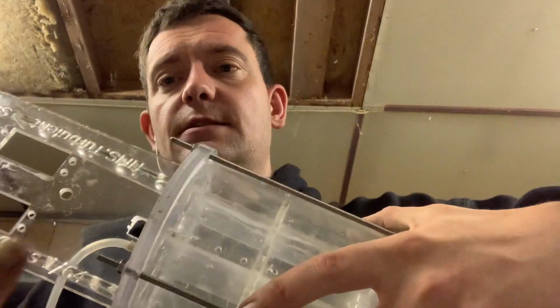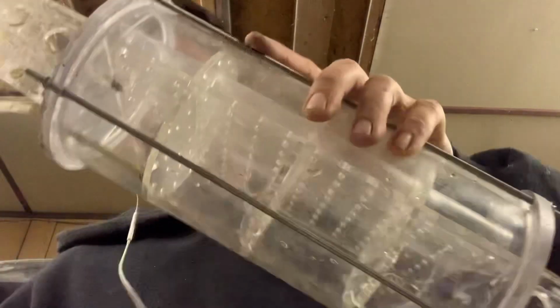Each system is exactly the same, so you have your servo trays mounted to the end caps on both sides, like so, and that eliminates any slop that you have in the servos. Now, this is obviously a modification of the old Shearline design, who was my predecessor, and I've put in a couple of my own tweaks to it, where the front servo tray has the engraving of the name of the submarine and also the class of submarine and its scale.